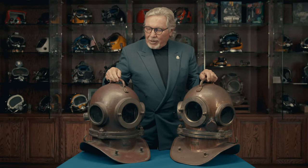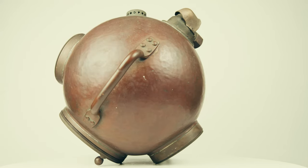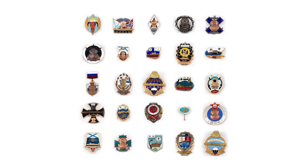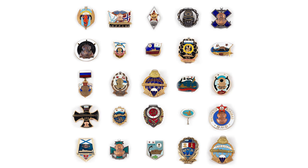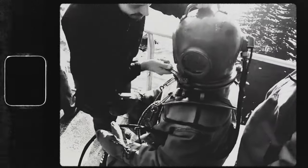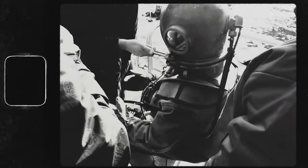These two are Russian Soviet Navy three-bolt helmets with the carrying handles on the top, and they can now be found in collections around the world. These helmets were built in Russia towards the end of last century, and as the Soviet Union began to slowly collapse, these helmets and other Russian diving and military equipment gradually began to filter out into the world marketplace. The obvious difference between these helmets and previous styles is that the waterproof seal between the helmet and the diver's dress is made at the neck ring, not at the outer edge of the breastplate.